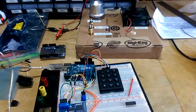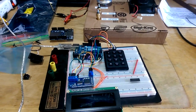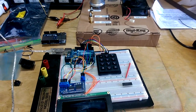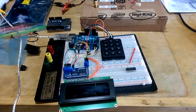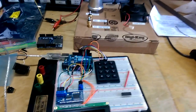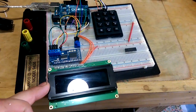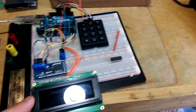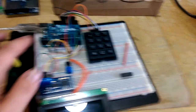For a lot less — this is like 70 bucks in Arduino parts and some stuff I had lying around — I can build a way cooler little car dash computer and monitor all sorts of things and also record data and calculate some things. Basically what I've got going on here is a little four-row, 20-character-per-row LCD screen, a little phone-style keypad, a little board that controls the LCD screen, and then the Arduino obviously.